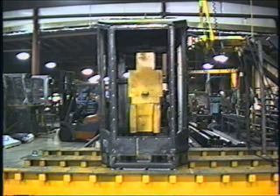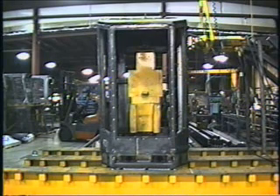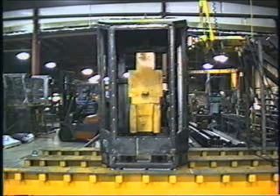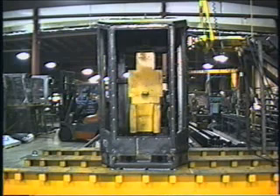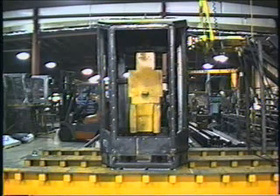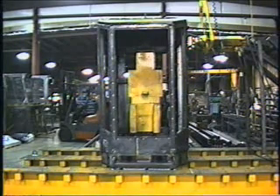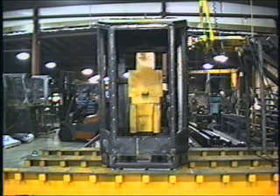Our target today is to attempt to certify this combined structure — or to be certifiable, I should say — for an excavator or other machine with a target finished mass of 50,000 kilograms. That gives us a target load calibrated in our system. Our system is calibrated in pounds and inches, imperial units. So our target load for that machine mass is 108,557 pounds or 482,905 Newtons. The energy absorption minimum required would be 860,316 pound-inches or 97,198 joules.